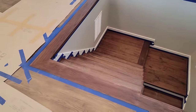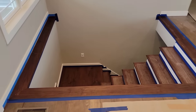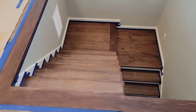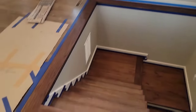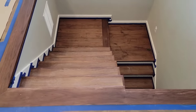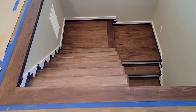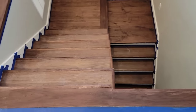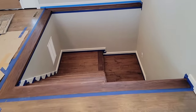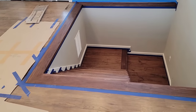I did get the stain put on these steps back over the weekend but I haven't shown you yet. I intend to today put the floor finish on — the epoxy stuff. So they need to be cleaned, wiped down, tack-clothed, and then we can finish all the walnut around the outside and all the steps. I did sand the treads lightly, scuffed them, so we're going to put a whole new coat of finish all the way across. I had sanded down the edges of the bull-nosing to try and get it nice and smooth and level. And then the boys came and walked on them yesterday and got footprints all over my steps, so we've got to wipe those down. Then we'll put a coat of finish on — it only needs about two hours to dry, and then I can put the second coat on. We're going to try and do them both today.